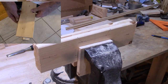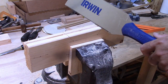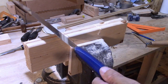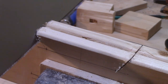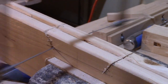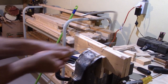Once we've cut our two one-foot planks and marked out our boards, we're just going to cut the grooves. Take your crosscut saw, put it at a 45-degree angle, eyeball it as best you can, and cut down to your depth line. Then we're going to get the coping saw — this is where a jigsaw would come in handy if you had one. A coping saw allows you to make cuts on either the push or the pull stroke depending on how you put the blade in, and it'll make tight bends so you can cut horizontally and pop out the grooves for your fingers.